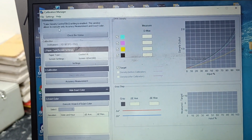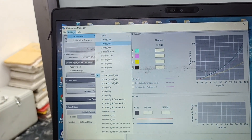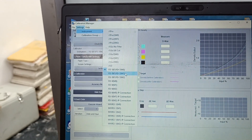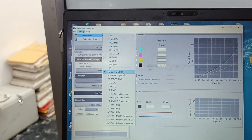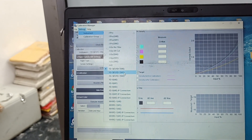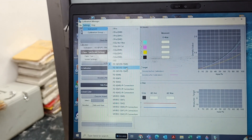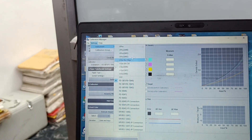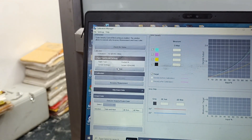I am selecting calibration. While performing calibration, initially we need to check the settings. Go to the Instrument section and select what instrument you are using — I was using the FD5BT, so I was selecting FD5BT. There are M0, M1, and M2 modes because of their light source difference. M0 is without UV filtration, M1 is with UV filtration. Normally for calibration we use M0 only, but if you are making G7 calibration then you need to use M1. If you are using the I1, you can select which I1 you are using. I was selecting M0 FD5BT.